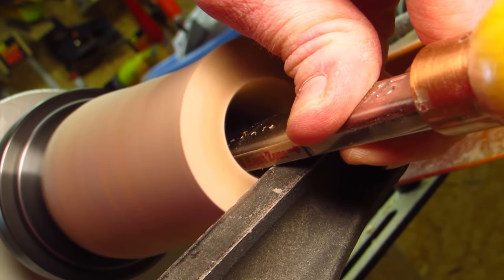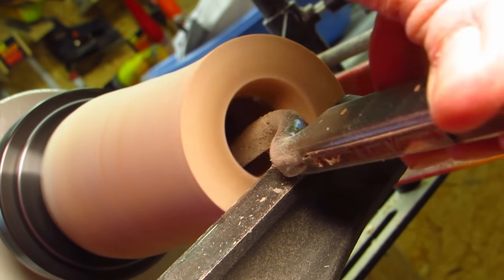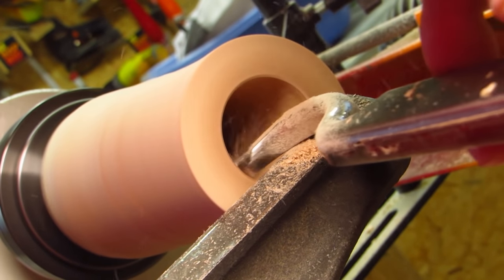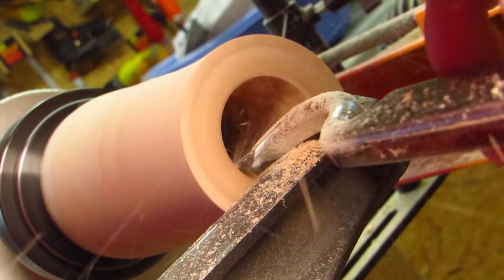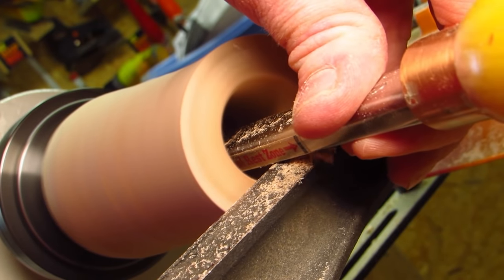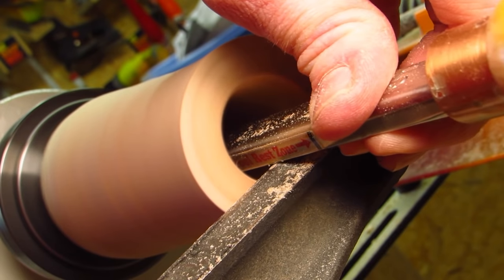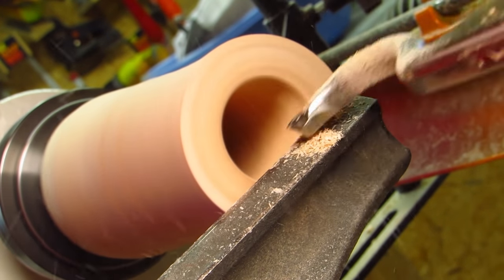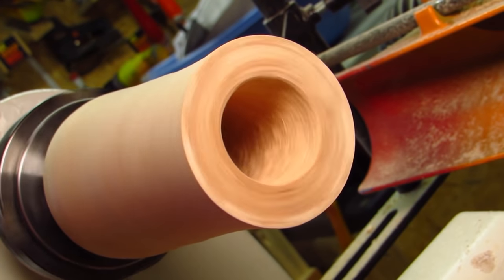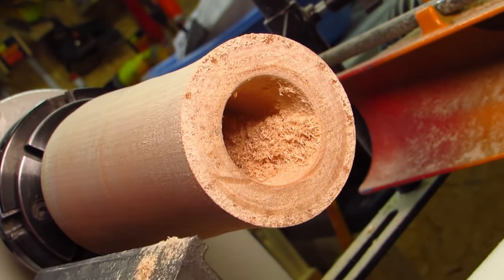In my experience these tools do not catch as bad as I have managed to catch with traditional ones. After a few meditative breaths I managed to find how I need to insert the tool — slowly and carefully, which is probably not much of a surprise. It is a lot about feeling your way along. The best way I found is to put the turning tool just a little bit into the spade bit hole, then drag it over the step in order to remove material. The best and largely only indicator that you are actually turning something is that the hole fills with sawdust, which I recommend removing every now and then.